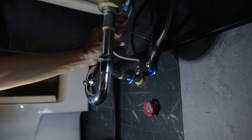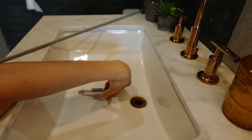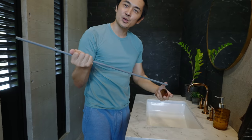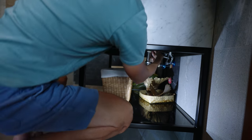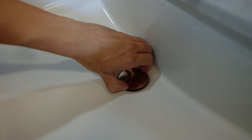What you're going to do is take this thing out — there's a ball and a locking mechanism — and then you can pull this out from upstairs. If this is clogged, it would be full of hairs most likely. You can put a newspaper or something here to help clean the pipe down, and of course have your bucket underneath to gather all the dirt. Then just put it back in — make sure to get the rod back into this little hole when putting it back in. It's quick and easy; you don't have to buy anything fancy. It's just a matter of knowing your plumbing lines down below.